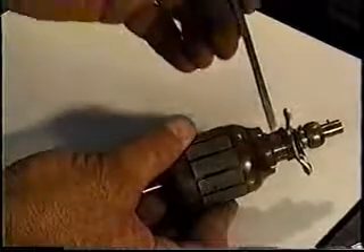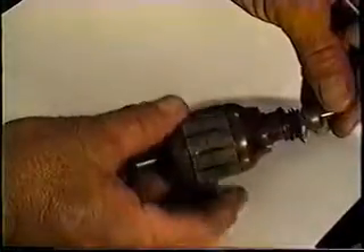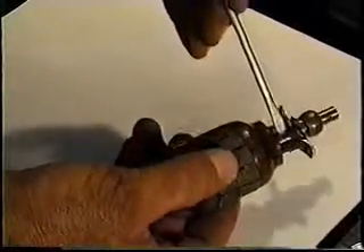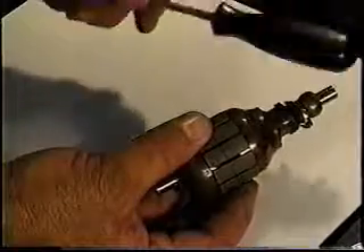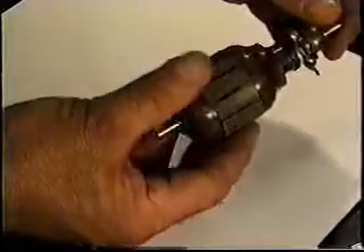This amount of metal — by the time this wears down to this point — the brush begins to burn. I'm going to turn this slowly until you get to the point where you see there's a big black spot. There's a shiny spot and then it goes black in there. Whenever this pump came to a halt on this point, the pump stalled. If you've ever had anybody tell you they went out and rapped on their fuel pump, what they did was bounce this just enough to get a better contact with the brush, and it starts spinning, and the pump would run okay for a little while.